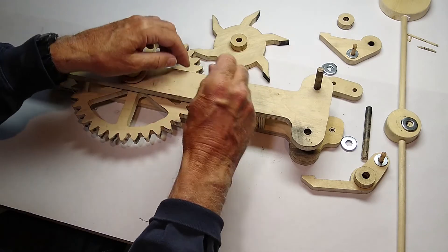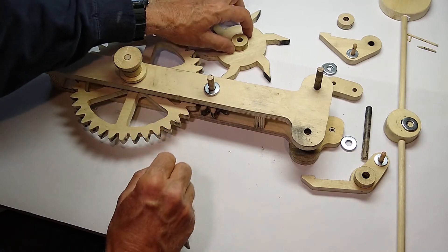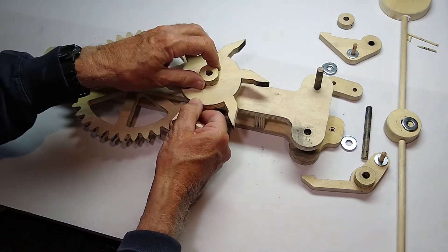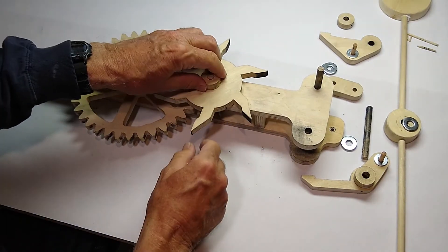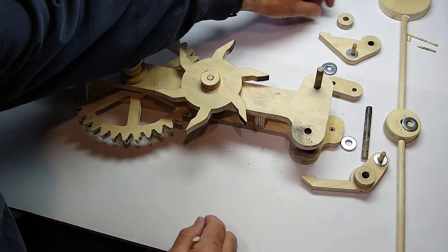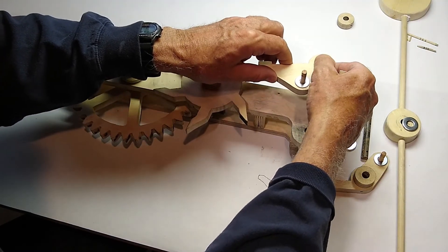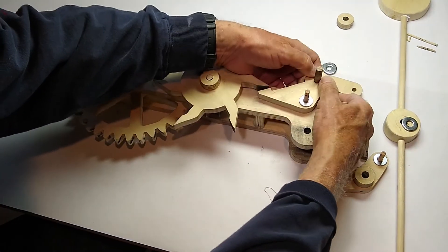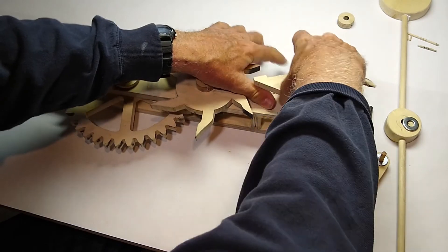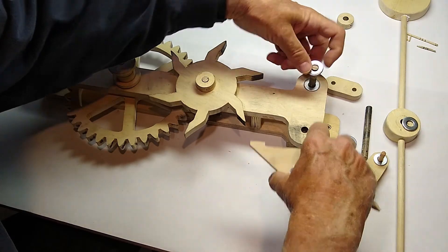This one has one little spacer on top, then these two spacers go on, then this spool. This is the shaft that goes in there — we have two spacers that go on that. This one is glued to the six-wheel. This shaft is stationary, glued in there, so the items I'm putting on now turn around the shaft rather than the shaft turning. You've got to have those spacers in there or it will rub.